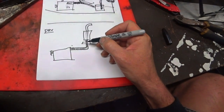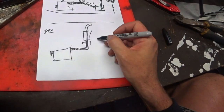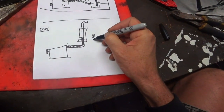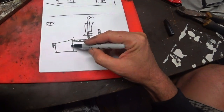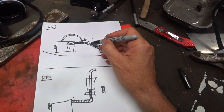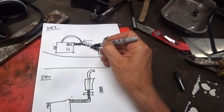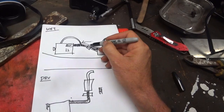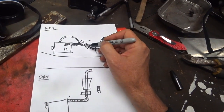Where pipes go through things there can't be hard fittings — it has to be able to slip through a ring that supports it, and you need spiral expansion joints in places. You need that because of the vibration of the motor as well, and you'll have that with both a wet and a dry exhaust. Once the exhaust has got water in it you can actually just use things like rubber hosing, which we'll see on my boat in a little bit, because the exhaust is cool enough not to melt the rubber.